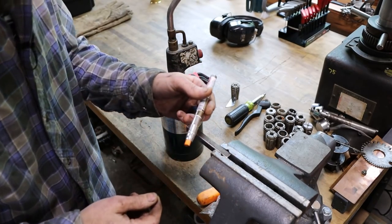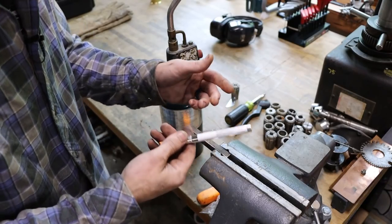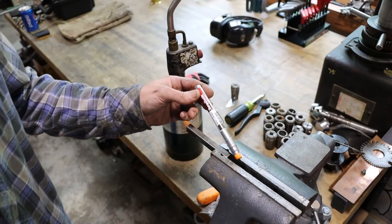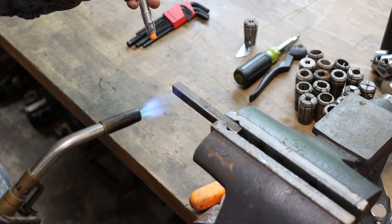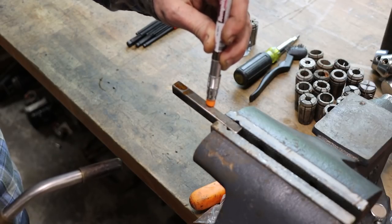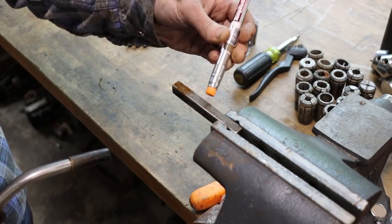These just get you close, but they are neat, and they are accurate, but you know, when you're heating something with a flame, it's hard to get a good smooth temperature on the whole surface. Good for welding prep or preheat. So there you go. Pick you up some of those. You can get them about anywhere, and they're not all that expensive and very useful. Keep you from overheating stuff. We're up to temp out here, but just right there, still too cold. They're neat. They work well.